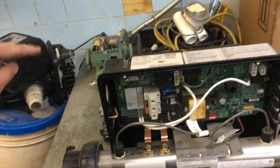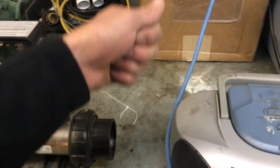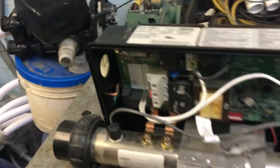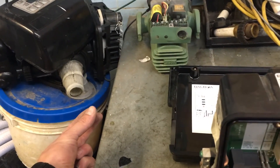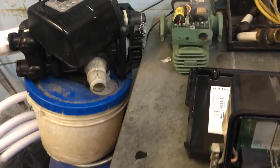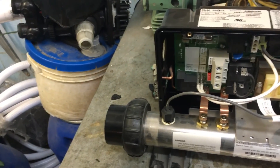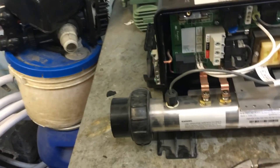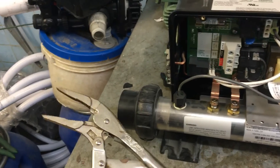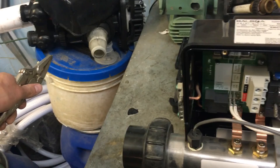The pump then discharges, comes in this side of the heater, discharges out this side, and then there should be another valve here to be closed. On the intake of the pump over here, you'll see a yellow 3/8 line traveling up — this is a prime line. So even with these two valves closed, that line is connected directly to a jet, so we need to clamp that off to prevent water pressure from coming through. I usually just use a pair of needle-nose vice grips, put that onto the line and crimp it closed while performing the service.